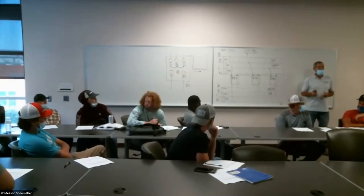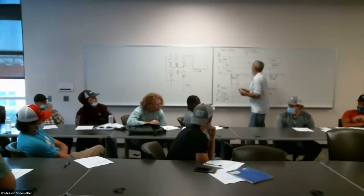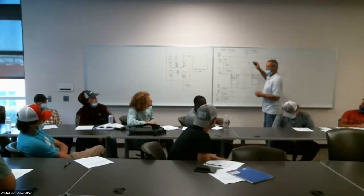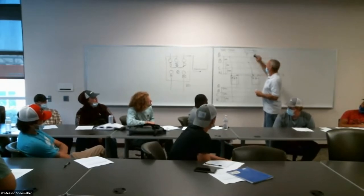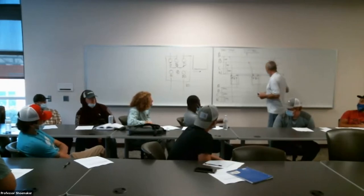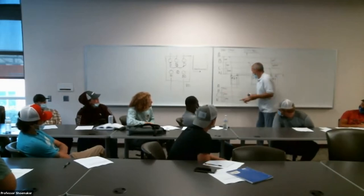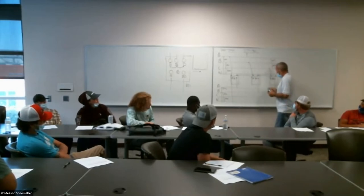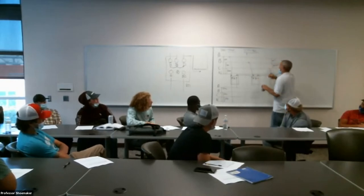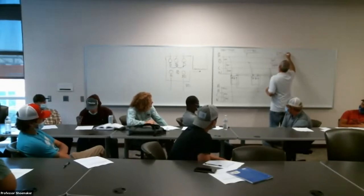Okay, so let's pick on a person. Why am I not getting 277 times 2? 554 volts. Right here, it's 277 phase to ground, right? Why, when I put phase to phase, two wires together, am I not getting 554 volts? I'm getting 480. Why am I not getting it?